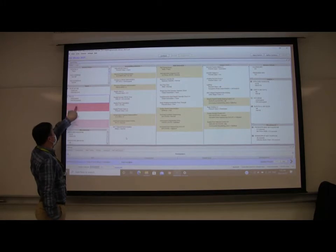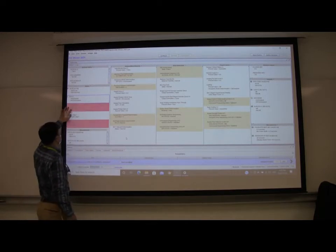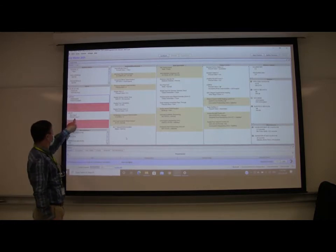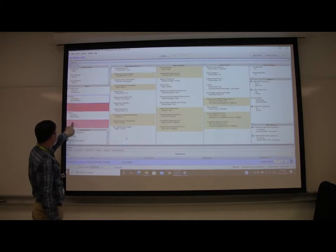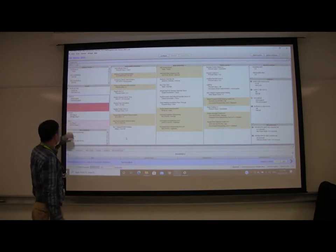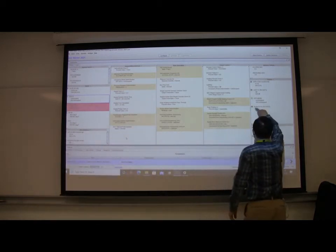And right now, this is supply air temperature, which is RTD. We connect RTD, sense the discharge air. Supply air temperature is 56 now, because this value is still changing. And this is the set point of the thermostat. Right now, it's 68. And the room temperature is 75. Now this one is still changing. So it shows the color red here. So output here, heating is off.